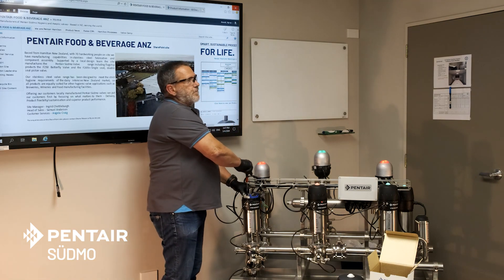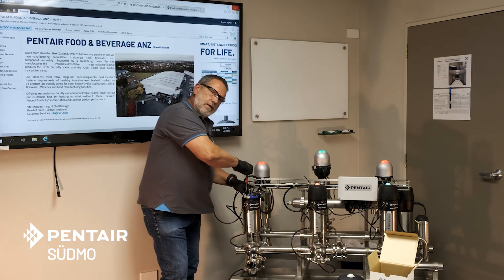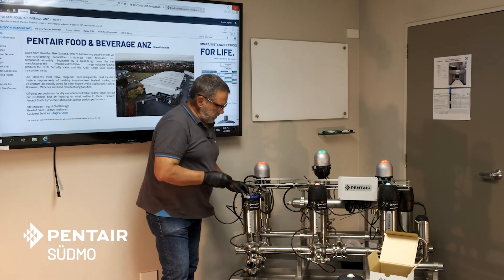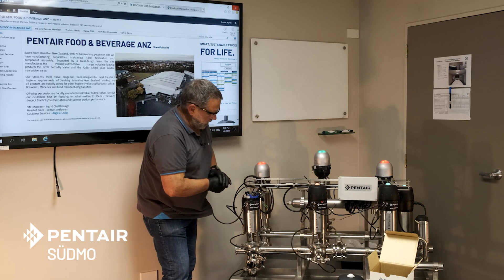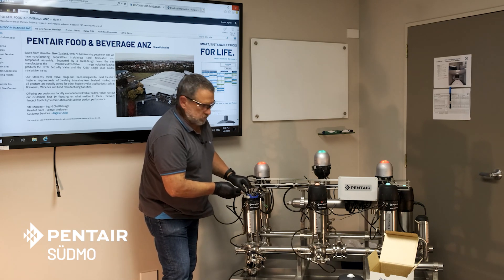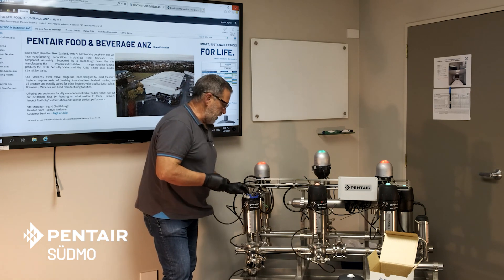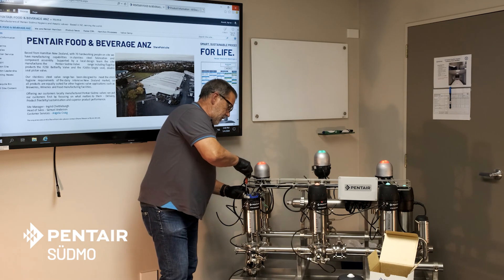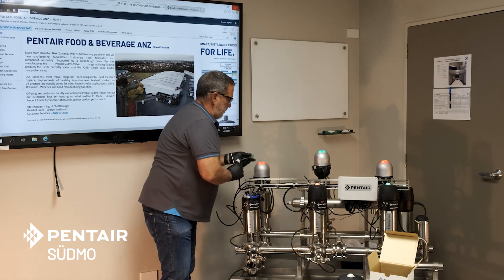Secure it in place. We won't tighten it all the way down yet because I do have to adjust this target up a little bit higher. If I tighten all the way down it'll crush the o-ring between the underside of the target screw and the base, and that'll lock it in place — that's our anti-vibration method. So we'll leave it a little bit loose for now until I get the power on. Just temporarily run the power in from the top.